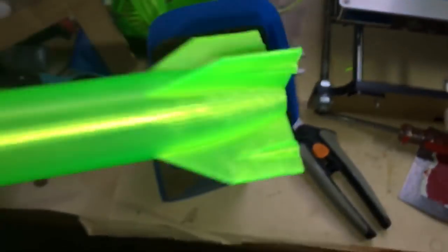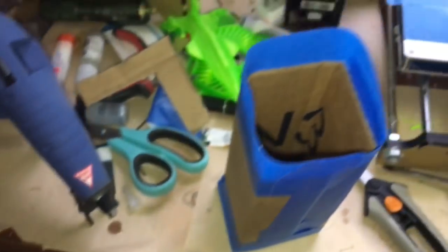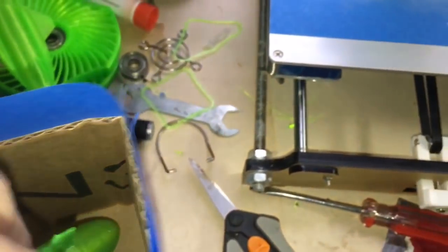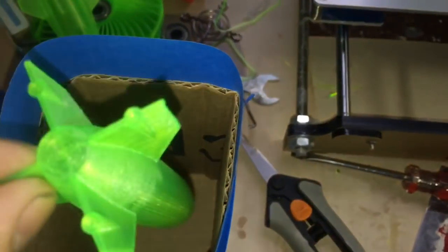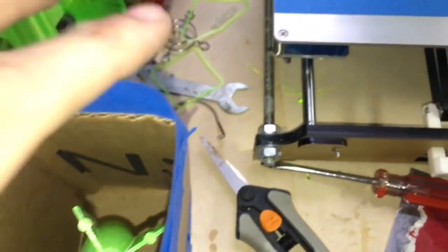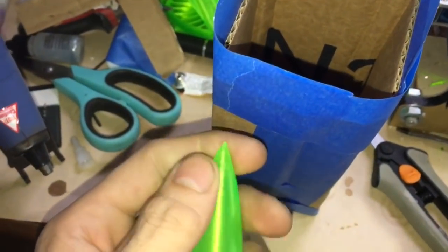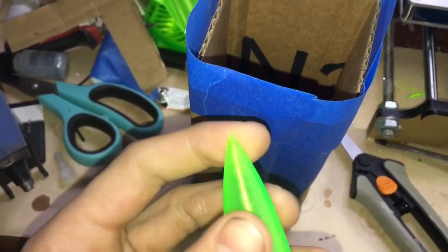What I'm gonna do to get the best casting possible, the easiest way to cast, is I'm going to hot glue the tip of this, just dip down to the very bottom there, and then it's gonna fill with plaster, set, then I can tear off all the cardboard, set it in the oven, melt the plastic out, flip it back over, and then I can fill it with my molten metal and hopefully it will come out crispy clean — except for the tip, which I can easily sand down with an angle grinder or a sander, or even hand sand it down if you have to, because hopefully the rest of it will be crispy clean.